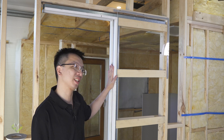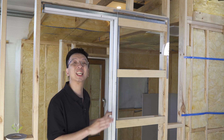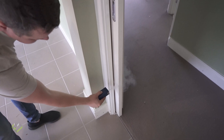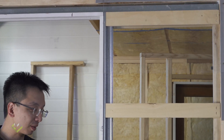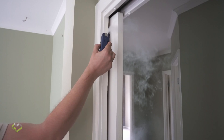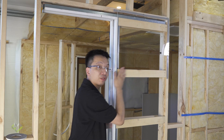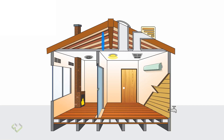Now, internal cavity sliding doors — these can leak a huge volume of air, because when the door goes in and out you've got a big gap on both sides. Typically when the plasterboard is installed it's not really flush to the frame, creating a big gap. Air can go around to the side, to the other part of the wall, or directly to the roof.